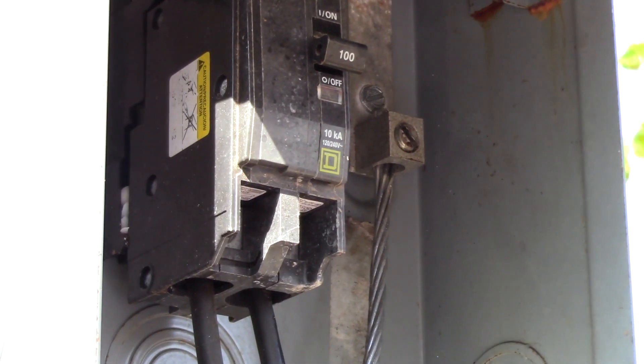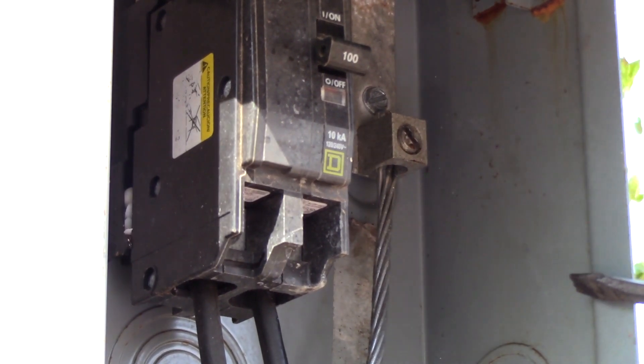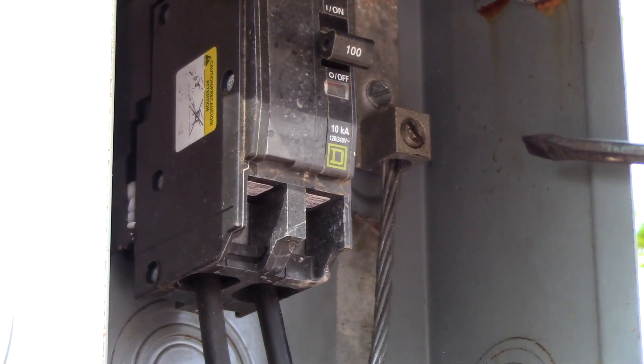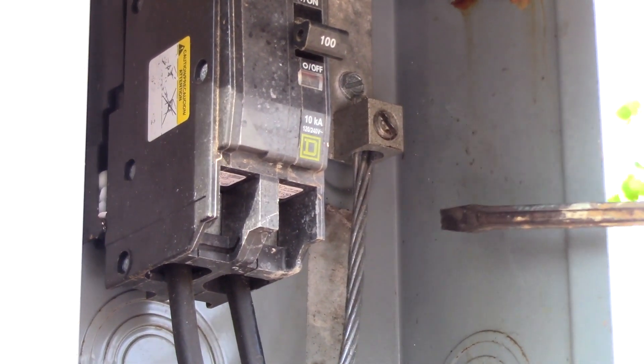Okay, so I had an extremely high resistance and it should be low — less than 10 ohms of resistance between the system ground and the ground wire and rod assembly. So that was way high, 35 meg or something.